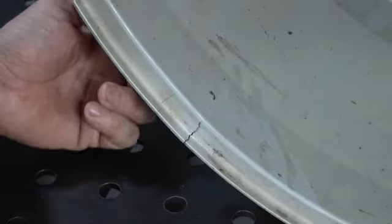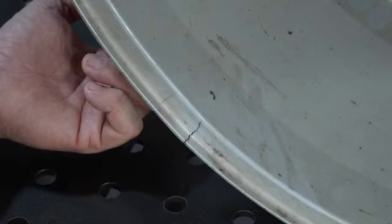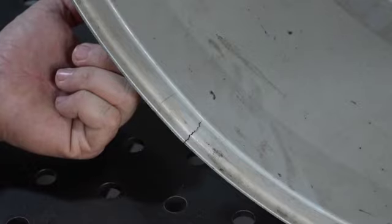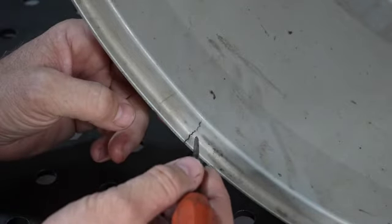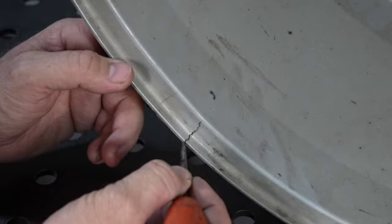Bad part is I don't have a compressor here at the shop, here at the Mafia headquarters, AKA my home shop. So I'm using my little small Bosch, which just takes forever. I can grind a little bit and I have to wait for it to build up. Once we get a bigger compressor, it'll be fine. But not a lot to die grind. We'll just take the little air die grinder and get that V'd out a little bit so we can get some good penetration.